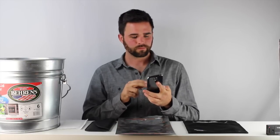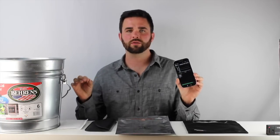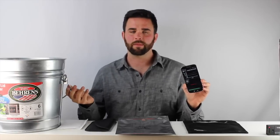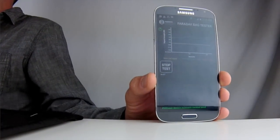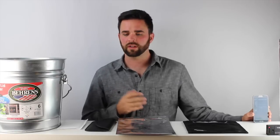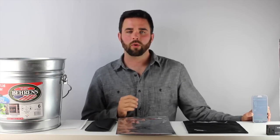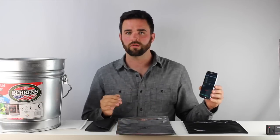We take the app, we click start test — it's a very simple app. You start the test, run about 10 to 20 seconds outside of your enclosure, place it inside for the same amount of time, and then take it back out and you should see a dip in signal strength. Right now we have about -70 dB in WiFi signal and about -90 dB in cell signal, showing that our WiFi is more powerful than our cell signal. It's important to note that a lot of different solutions will block cell signals but won't block WiFi, and it's important to block WiFi because data, text messages and even calls are often placed over WiFi.